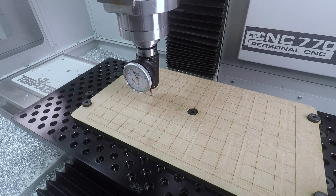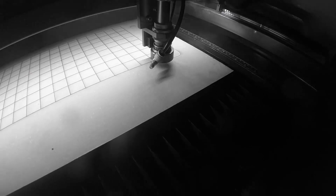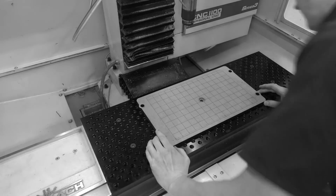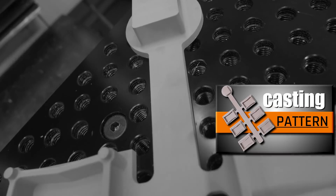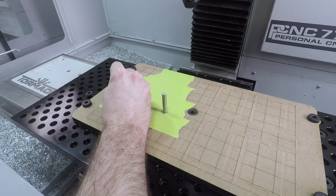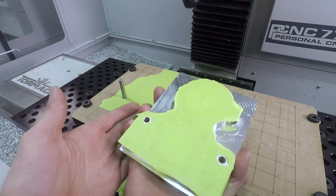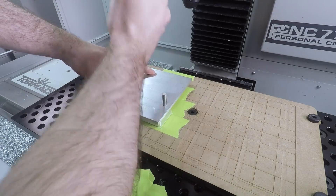So we're done with op one. Op two is tricky, but let's stack the deck in our favor. We're using the MDF base that we laser cut for the casting pattern that we machined out of aluminum back in Wednesday Widget 193. By putting a couple of interpolated holes in there with dowel pins, we can then super glue it, and when we put it down on our part, we've got really good known alignment because we just machined those holes in place — very similar methodology to soft jaws.